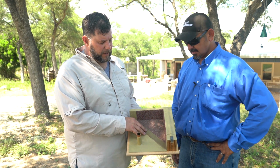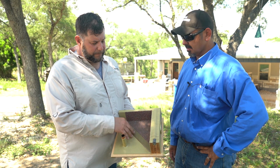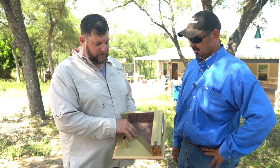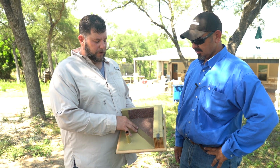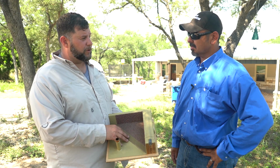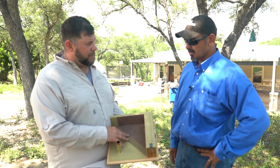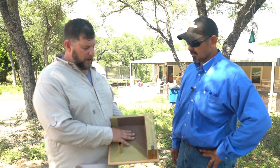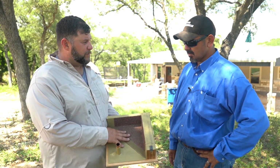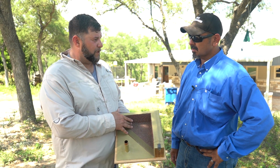This is a 3-component urethane traffic coating. Two components being the liquid resin itself and the catalyst, and the third component is a mineral filler. You mix all 3 components together. It goes down with a quarter inch by quarter inch notch trowel. You let it harden up for about 7 to 8 minutes, depending on the temperature, and then you broadcast this colored ceramic quartz into it. After that cures for about 12 hours, you come back and put a single component clear sealer on it. Okay.